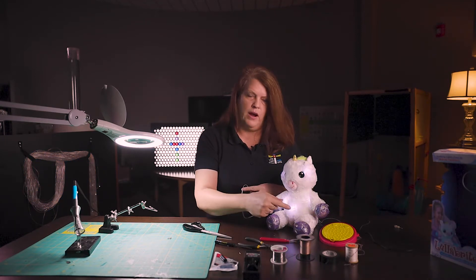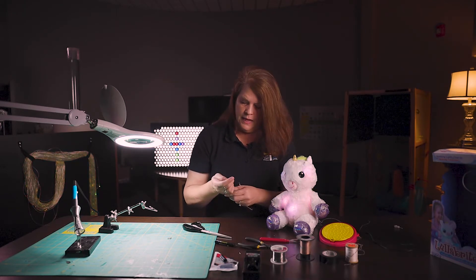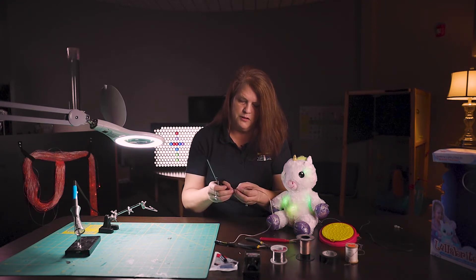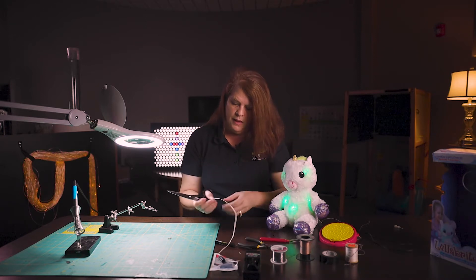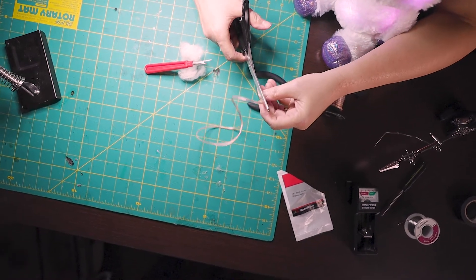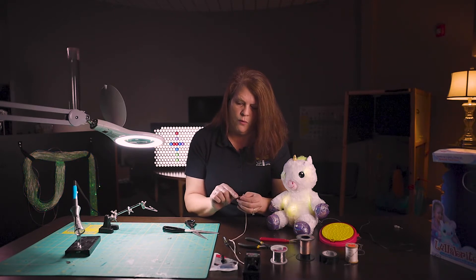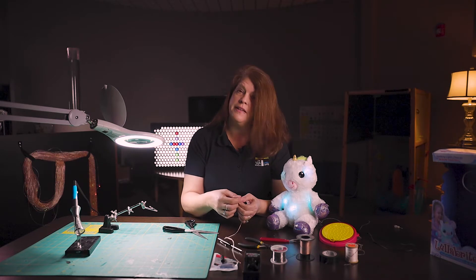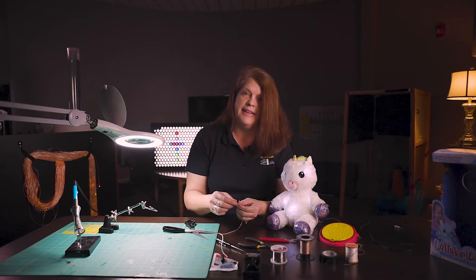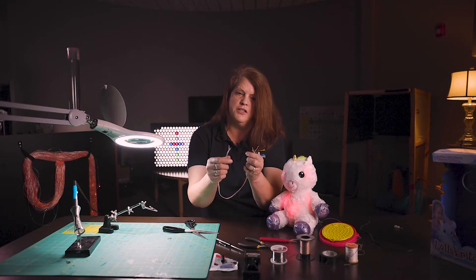This is definitely a different gauge than the wires on here, but that's okay. What I've done is take my scissors and cut between the two wires — there are two wires in this strip and I need to get to both of them. So I'm going to cut in between those wires. Be careful not to take off any of the casing — you don't want any wires showing because then they'll end up touching each other and your toy won't work. Then again we're going to strip the casing off of each of those wires.